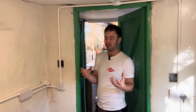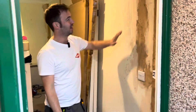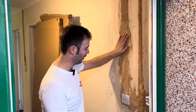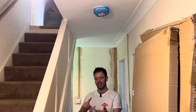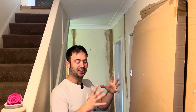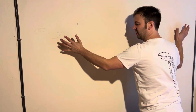It's concrete floors again on this rewire, so everything was chased from above. I've bonded all the chases as well. We've got two-way switching — smokes on the upstairs landing, hallway, kitchen, and in the garage. It's not a strict requirement but I like to fit a smoke in an attached garage. If it's detached I'm not too fussed, but when it's attached I feel it's appropriate.